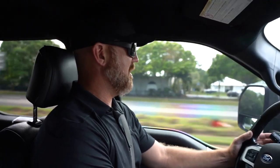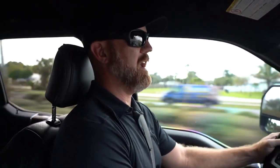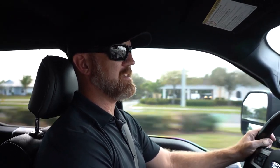We'll make note of fascia at that time as well. In the event there is no rotten wood, or if there are only rotten sections, we want to make sure that the existing roof deck is being nailed to code properly. So that's what we're going to be inspecting right now on this first job. Then we're going to talk briefly to the homeowner and let them know where the roofing contractor of his choice stands on day one of his project.